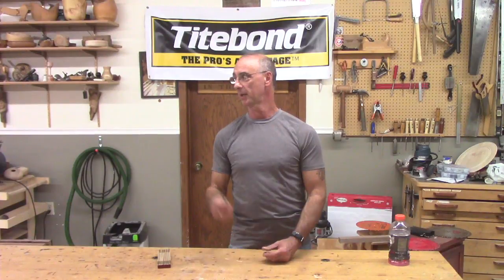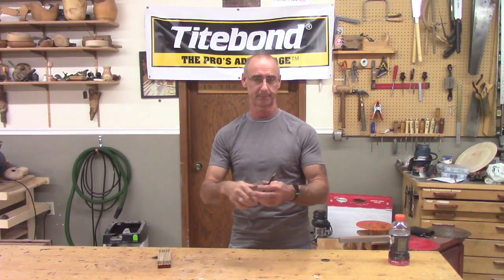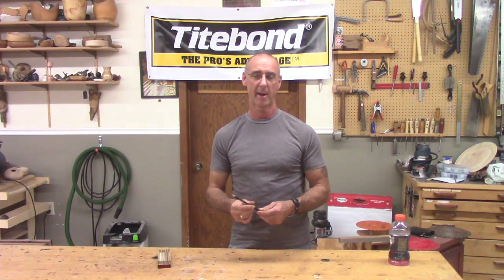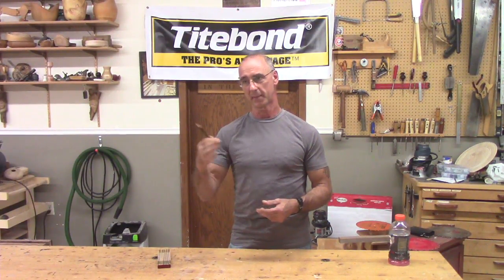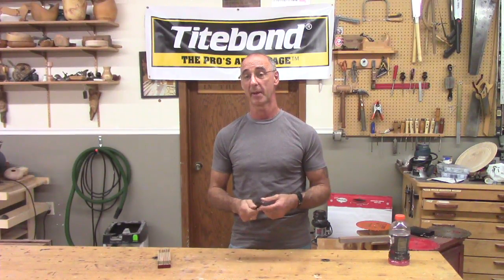All right, and Scott says, can I use regular big box store plywood for shop-made jigs? Yeah, it's not a great idea because the plywood quality is marginal. Depending on the jig, there's some stuff hanging on my wall that's made out of MDF. There's a lot of stuff made out of Baltic birch or multi-ply plywood, just because it holds up so much better. If you're making a jig you're going to use one time, one and done, big box store plywood might be okay. If it's something that you're going to use repetitively, either MDF or multi-ply plywood is a better choice because it's going to hold up better, it's going to be flatter.